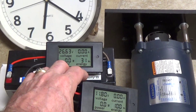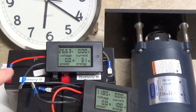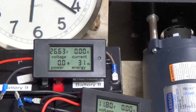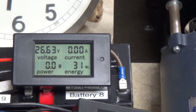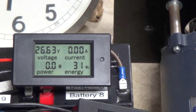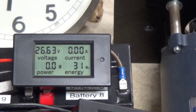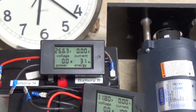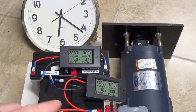Below 12 volts a battery is pretty well drained. At the back I've got two batteries connected in series — those are also good, well-conditioned, charged batteries sitting at 26.63 volts, meaning there is at least 13.3 volts across each of them. So identical charge on those, and they're in good condition, just like these two here.